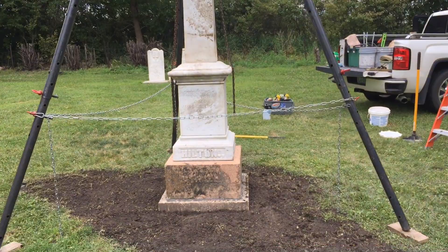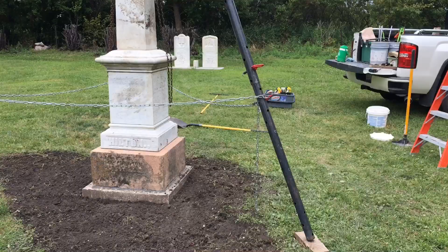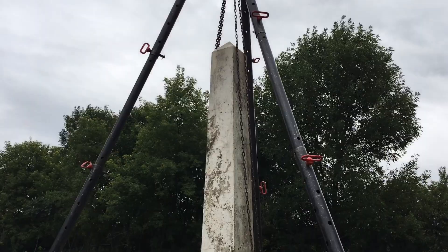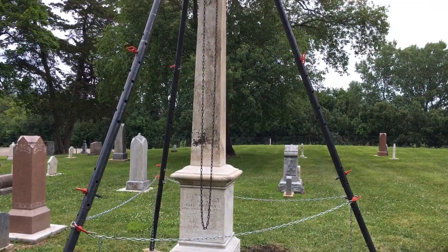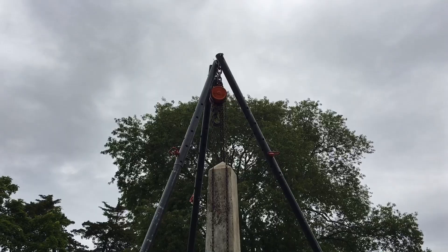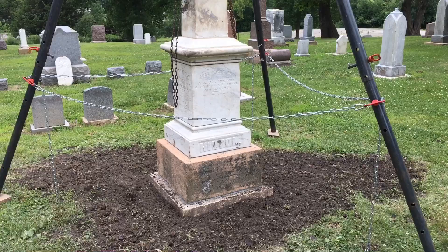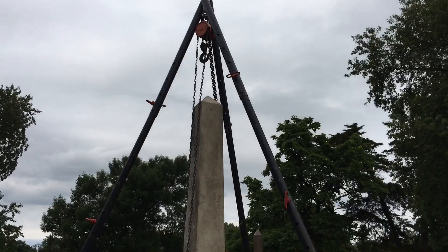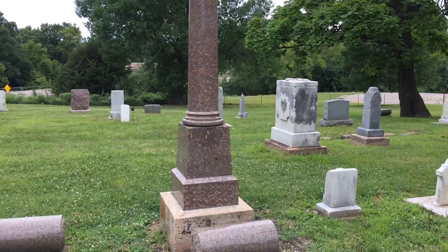From about that bottom base, it's about 10 feet tall. The legs are spread equidistant at about 9 feet. With the pin configuration I've got, I do have about 6 more inches of extension that we could go. But right now, just for reference if somebody else is trying to build this, I can lift 11 feet — that hook on the chain hoist is roughly 11 feet from the ground. Maximum lift, maybe bringing the legs together a little more, I can probably get about 11 and a half feet. So far, 11 feet on this one, and I was probably in a similar configuration when I lifted that one too, which is also nearly 10 feet tall.